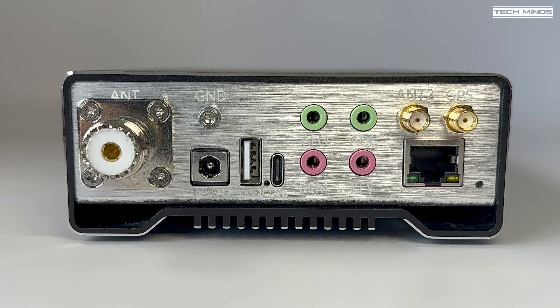Incidentally, the CAT control protocol is the same as the Yaesu FT817. Next to the USB-C connection there are 3.5mm sockets which can be used for audio, PTT control, and a CW key. The ethernet connection is apparently unused at the moment, just like on previous models. Above it there are two SMA connections — one for the GPS antenna and the other is antenna port 2, used for transmit and receive on VHF and UHF.